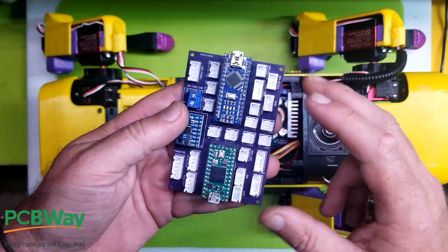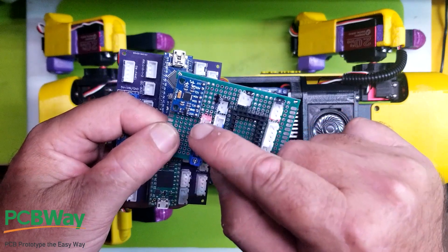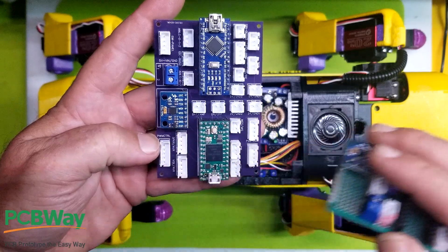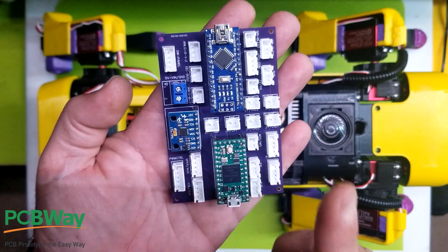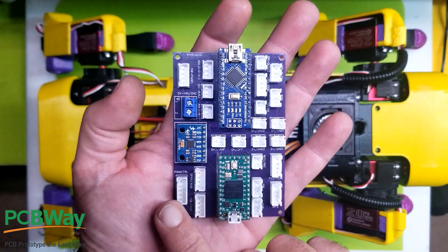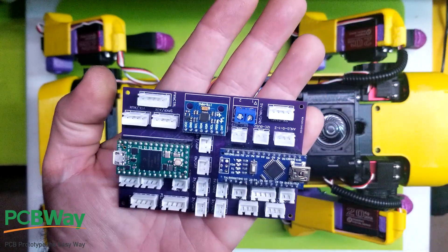For those of you who did make the DIY boards — the Teensy one — the PWM controller JST, I did reverse the pins, so be very careful of that; everything is flip-flopped. You'll see that in the diagram for wiring this board as well, so pay close attention. I actually forgot, wired it all up, and Nova booted but the PWM controller was not responding. It didn't cause any damage, thankfully. I just realized — oops — I forgot to reverse my JST, so I did that and we were back in business.